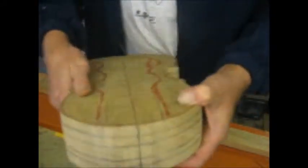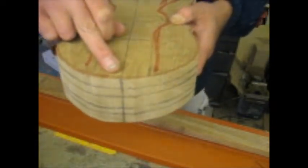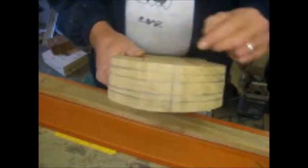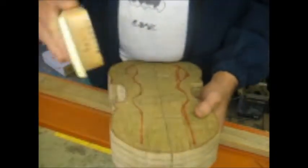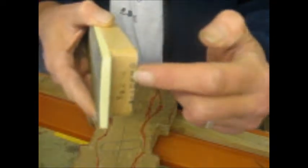What I've got to do is line this neck up so it's absolutely straight with the centre line, because you don't want your neck going off at this angle or that angle, obviously. And I've got to cut the slot out for the neck. This is two centimetres — the depth from the fretboard, the depth from here to here is two centimetres.